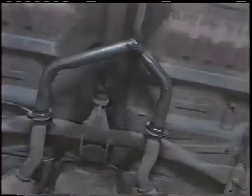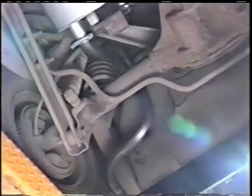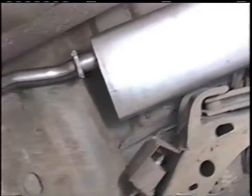Once you're done with this job, you want to be very fussy about it. We are. We went to the extent of doing everything correct all the way. We even went to the extent of having clamps level. The last thing that we're going to do now is go back and trim the ends of the clamp off. Two reasons. Nuts don't come loose. The job looks finished.